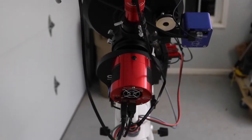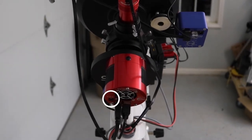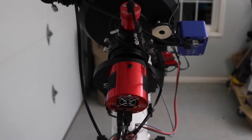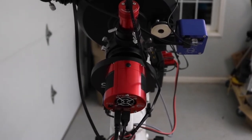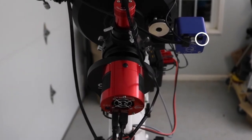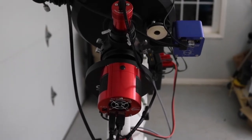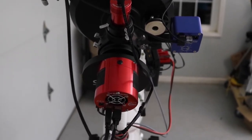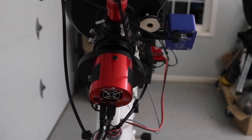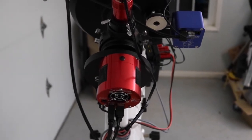Here's some of what I'm going to convert. You can see my ASI 1600MM Pro camera on the back has a 12 volt power supply input DC, and on the upper right I have my Pegasus Astro Focus Cube 2, which also requires 12 volt DC power. I'm actually going to cable that up so I can run it off the distribution block and get rid of both of the bricks - there's no need for a brick and a bunch of extension cords.